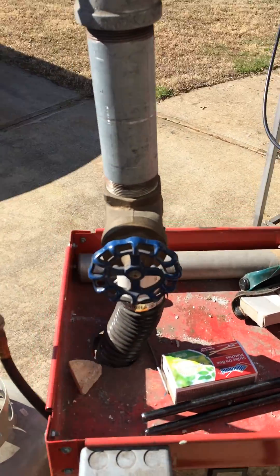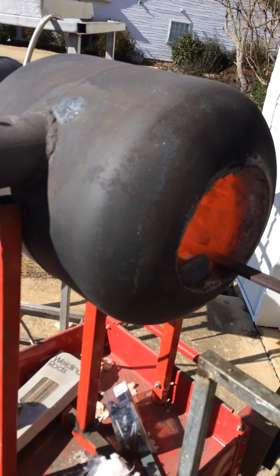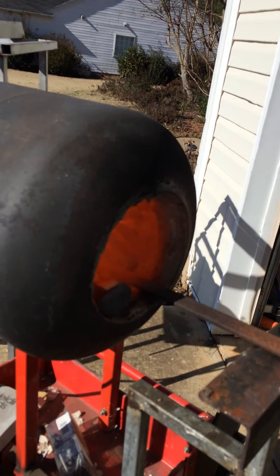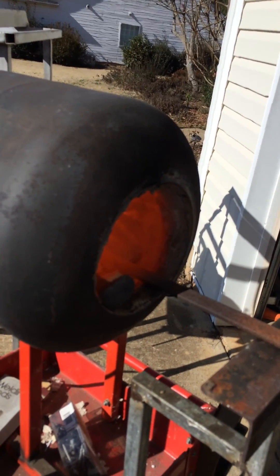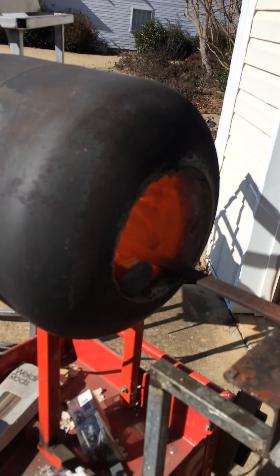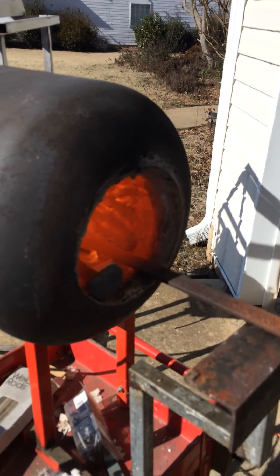This is a gate valve that controls the air flow, so I can dial it back. And if it were daylight now, you can see that the flame ratio has changed. It's really reducing right now. And then I can bring it all the way up and be heavy-duty oxidizing flame.